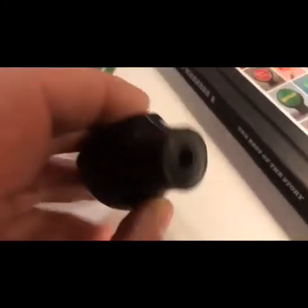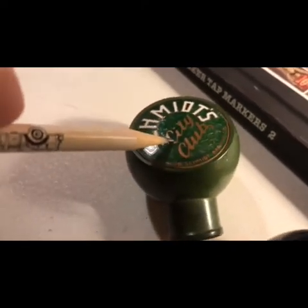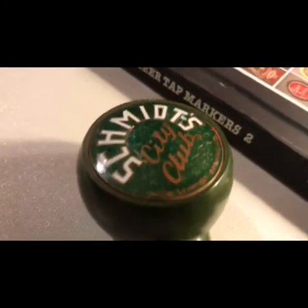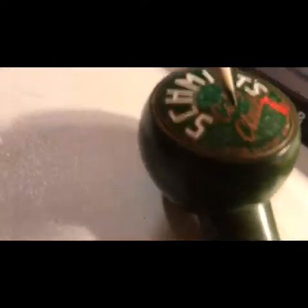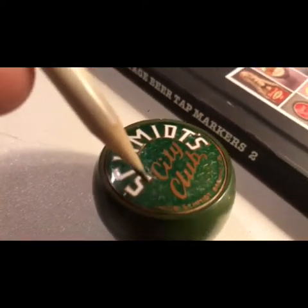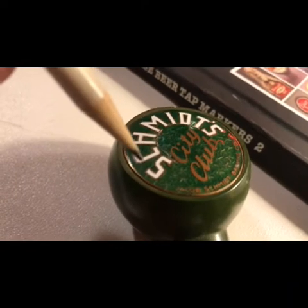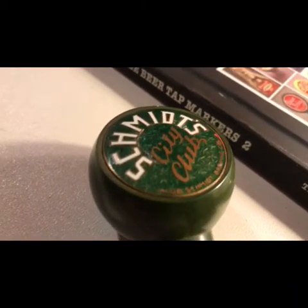This back housing — as you can see down here — is threaded to go into a tap knob line. I believe it's a standard half-inch thread. These would go on the tap line and then they would pull forward to dispense beer. You see these metal faces on a typical ball knob — this was done and then there was a Dura enamel or Dura color filled in back. We use it in the jewelry business — it can match PMS colors or the brewer's brand colors. It is a liquid that flows in and requires a wall to stop it or something raised. A person would go in with what almost looks like a hypodermic needle and fill in the white in the letters, which have a raised wall to contain the color. Then the tap knob face was put in an oven and cured.